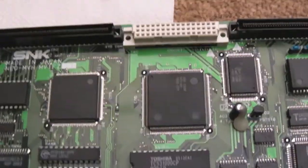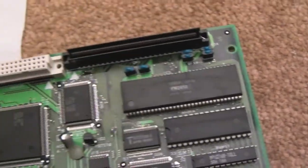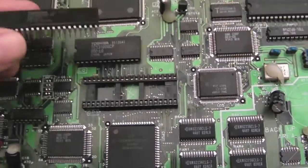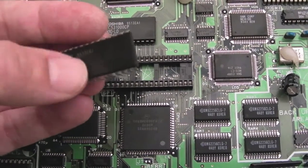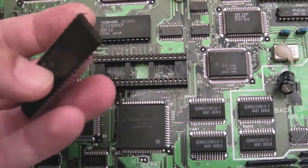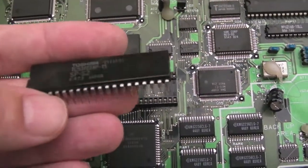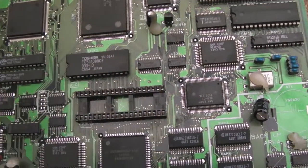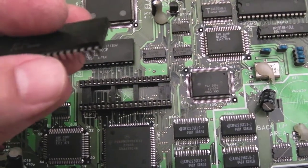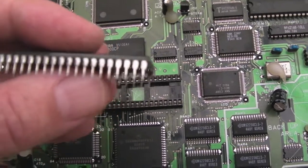I've cleaned this up a bit because there was some corrosion just down here on one of these pins and the same over here. The ROM chip had some corrosion on the top — something had dripped onto the ceramic package and it was on a couple of the pins as well. What I've done is used a wire brush first, and then fine grit sandpaper to sand the top, side, and underneath of each pin — and it's back to looking like brand new.